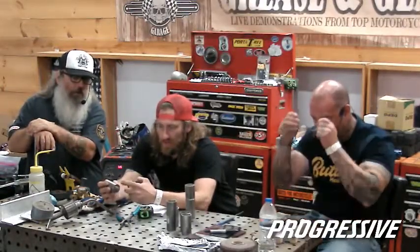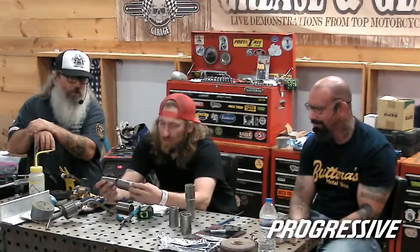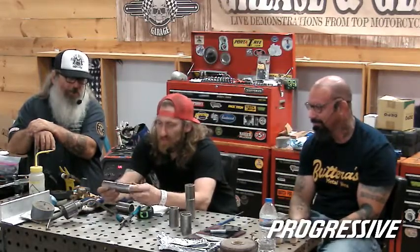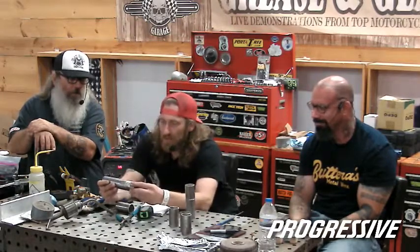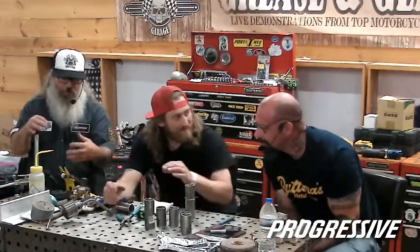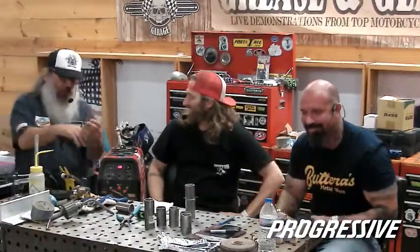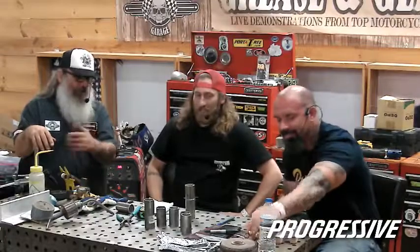So I'll either put an A, and I know these two cuts were from the same piece. Then I'll put a scribe line down it so that I can pivot it and line it up perfectly. You also want to do that if you're building something specific, so you don't accidentally weld the wrong pieces together. It's like mocking up your setup.